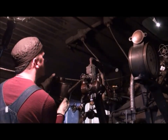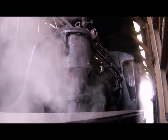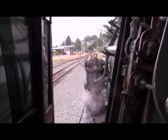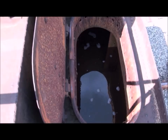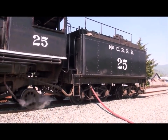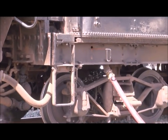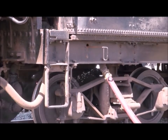This is the mechanical lubricator — another thing that we have to fill every day. And sometimes you overfill it, which is why you want to have clothing on that you don't care about getting dirty. One of the last things we do before we go out of the shed is turn on the air compressor — you want to make sure that you get all the fluid water out of it, and leave the drains open long enough. And now it's time to take the locomotive out of the shed. Here we go for another day of train riding. Now that we're outside, the first thing you're going to do is check the water — taking on water is an everyday event. We use about 10 gallons of fuel per mile and about 100 gallons of water per mile.